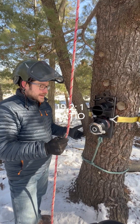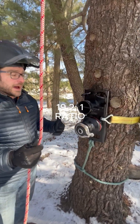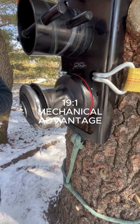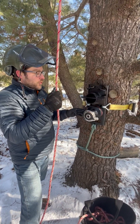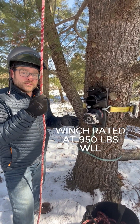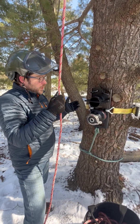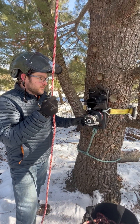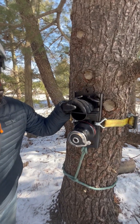It's got a 19.2 to one ratio for power — basically that's a 19 to one mechanical advantage. For what we're using this for, we've rated it at 950 pounds working load limit. You don't really want to be dropping huge pieces of wood into this winch, that's why we've included the steel bollard.